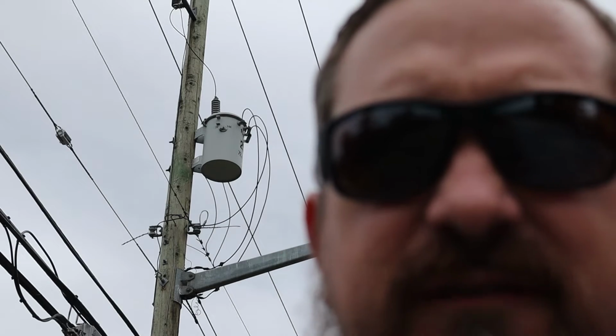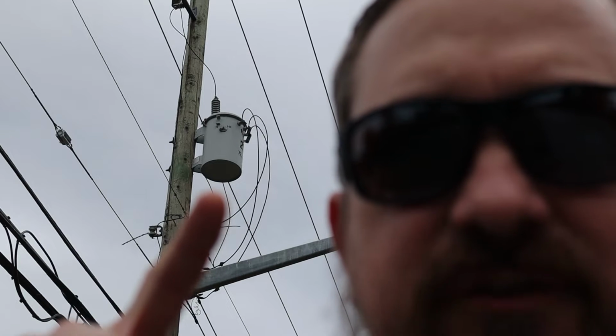And these are the high voltage transmission lines that are coming from our step-up transformer from the power dam going to our local substations, and these have lots and lots of voltage. Once the step-down voltage of about 7,000 to 10,000 volts comes from our substations closer to our home, we still have yet another transformer. This is a residential transformer, and this is going to turn that down to 120 volts, which is what we use inside of our house.